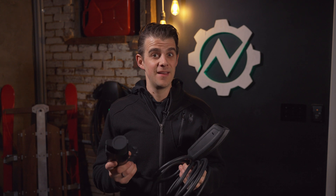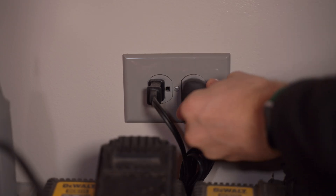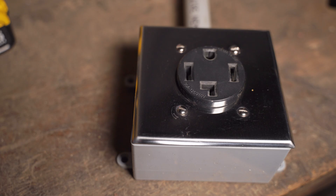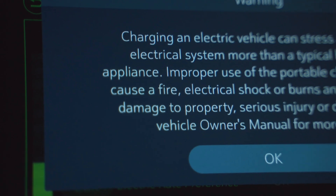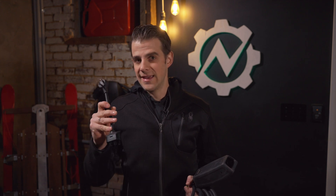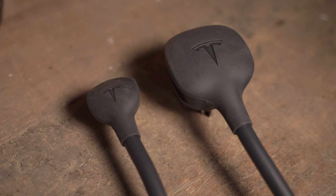I did use some expensive tools, so if this is something you'd like to do, hit me up. Overall, I love it — it works just as expected. When I plug in the NEMA 520 20 amp 120 volt plug, it charges up to 16 amps. When I do the 30 amp NEMA 1430 plug, it charges up to 24 amps, which is what I expected. One note: my Chevy Bolt actually caps 120 volt charging at 12 amps, so although the Tesla charger will allow up to 16 amps with that plug, the car only pulls 12. I should probably switch to the NEMA 515. But I now have so many options — all eight of Tesla's adapters plus the aftermarket adapters available online.